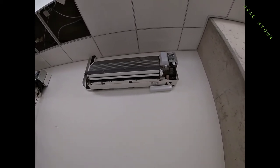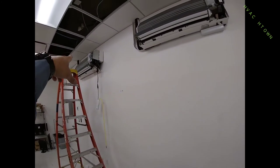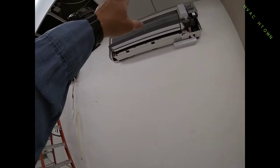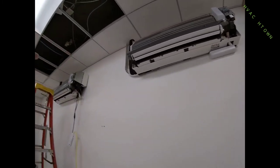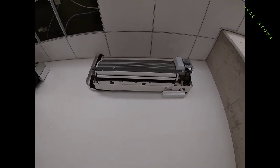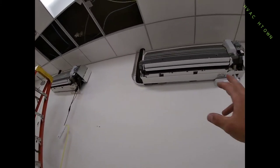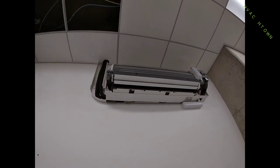I got the communication wire run and my MA controller wire run to that indoor unit, then got communication daisy-chained. I need to go pick up some tubing so I can run that condensate drain line — I got some plans for that. Still looking a little rough right now, but we'll see how it looks at the end. Still waiting on the electrician to come and bring power to these indoor units.